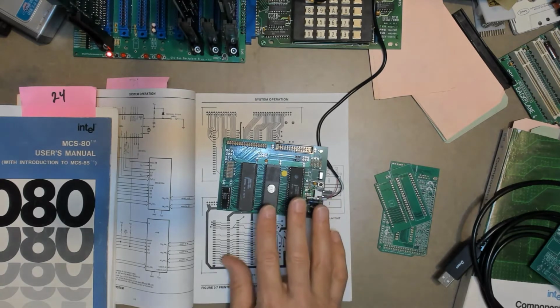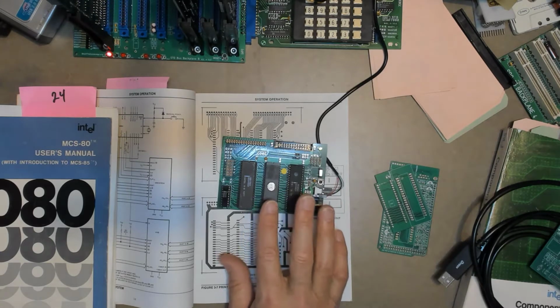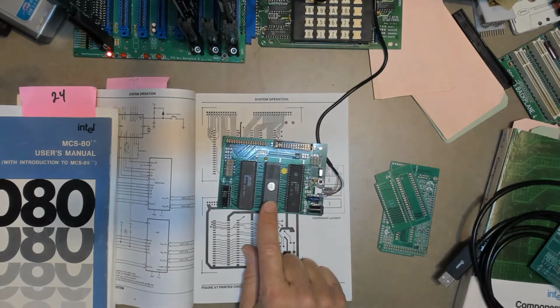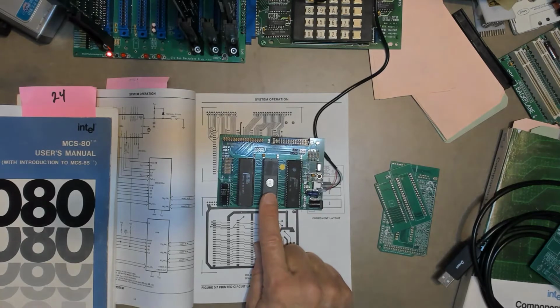But really that shouldn't even be a showstopper if you're really interested in this platform, because there is an easy solution for this. Now, to back up a bit, the 8755 programs almost identically to the MCS-48 family, so the 8048. Intel recognized that, and back in the day you would basically just use an adapter card and program the 8755 on an MCS-48 programmer.